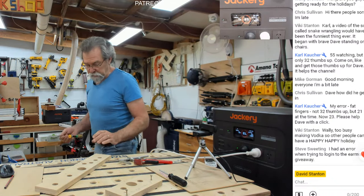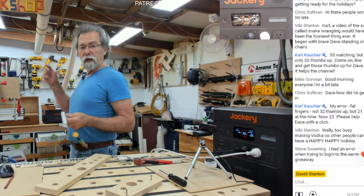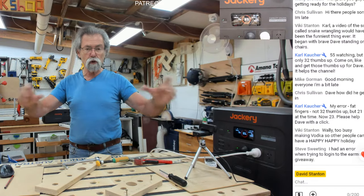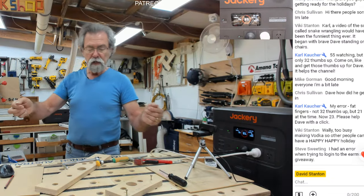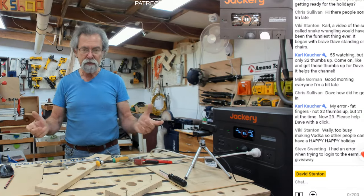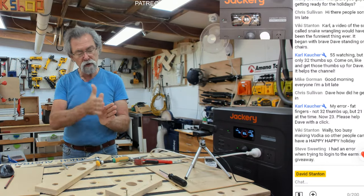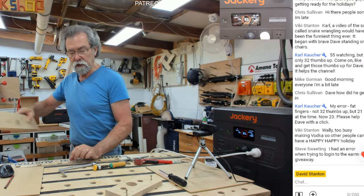One of the other things I'm about to make, and that's why I'm using my small router table, is another box for that toolbox. It's going to be similar to a knife block, but I don't know if you know the style that I'm talking about. I'm going to make a very shallow drawer that fits in there under the bigger drawer by about that much. And it can slide backwards and forwards so I can put my hands around it and take it out. It's going to be a shelf with a rim, basically. So it's going to have dovetail joints all around, with a rebated floor into it. And then in the top, it's going to have a piece of wood that's got some slots cut in it, so I can put my saws in that way. Click, click, click, click across.